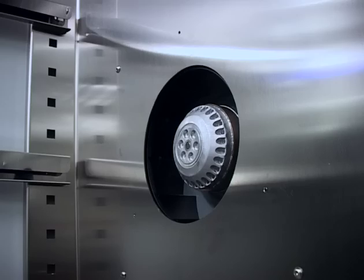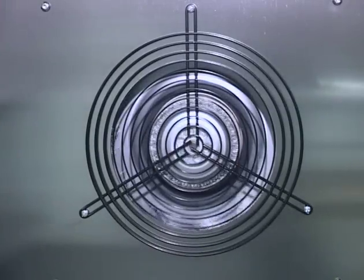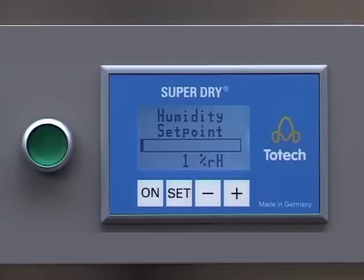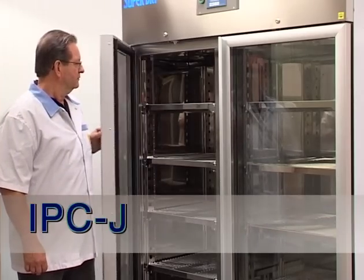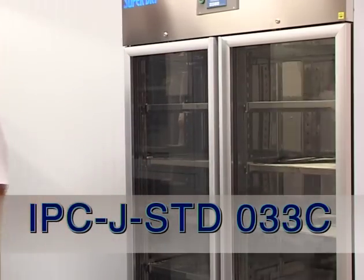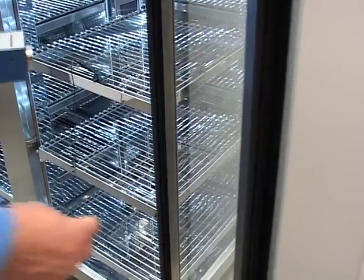Heating of air by means of a radial fan offers equable convection and deviation of temperature with temperatures up to 60 degrees Celsius. The drying performance that can be reached is exceeding the IPC standard, and at the same time, the sensitive components and their containers are well protected. All surfaces and glass windows are executed ESD-safe and offer protection against dangerous electrical charges.